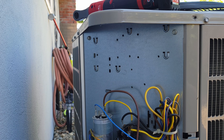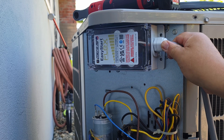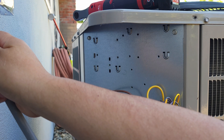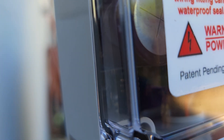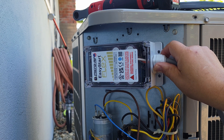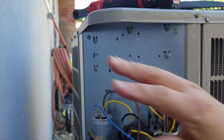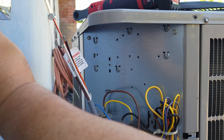Now for where to mount the unit. On a Bryant there's plenty of room — I could do it horizontally or vertically. But I'm going to mount mine on the outside of the house on the wall, mainly because it has diagnostic LEDs that flash, and if I mounted it behind the panel I won't be able to see those lights. There is a Bluetooth app that will also give you diagnostics, but I think it's better to mount outside on the wall. The great thing about the Bryant is that this side faces the house, so there's plenty of cable length — that should not be an issue.